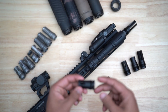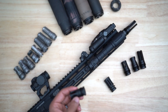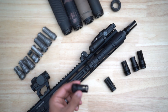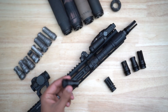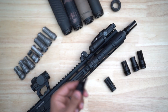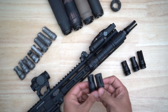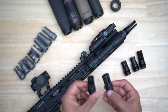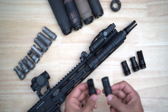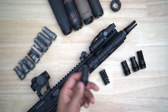The first device we're going to talk about is the 63-15 and 63-10 RF, which was released first. The 15 is designed for AR-15s, threaded in ½-28 and optimized for 5.56/223 cartridge. The 10 variants are 5⁄8-24 and optimized for 308, 300 Blackout, 6 ARC, and 338 ARC. The 63-15 RF and 63-10 RF are A2 style flash hiders, slightly shorter and lighter than a standard A2. Due to internal geometry changes, flash performance is similar to a standard A2, and they also have a closed bottom which helps reduce dust and debris when shooting prone.